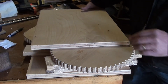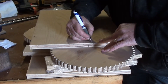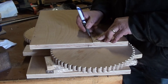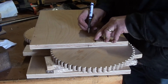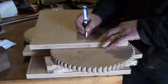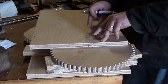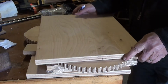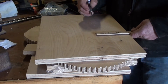Let's position that right there. Come in two and a half inches from the edge and put a mark. This one is a bearing — mark that so we know there will be a bearing mounted in this board here. On the last one, the bearings will be in the gears. So if we come straight over — how far up are we here? Five inches. If we come over here five inches, as such.